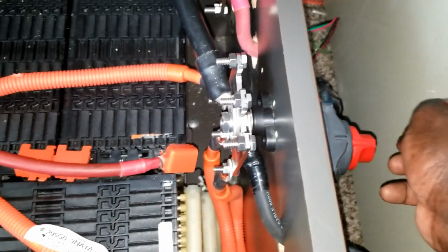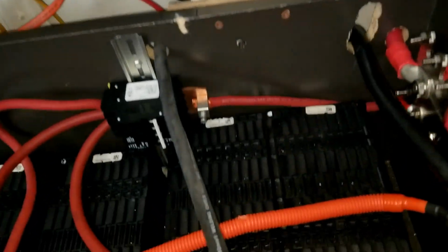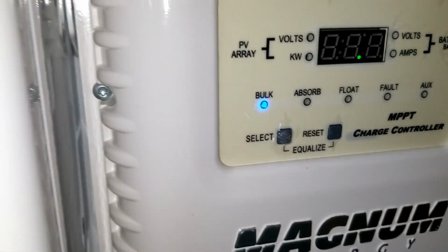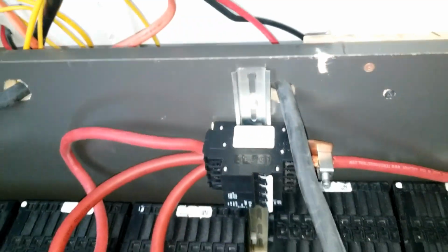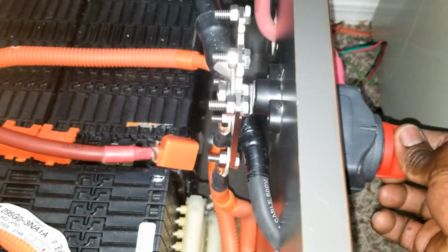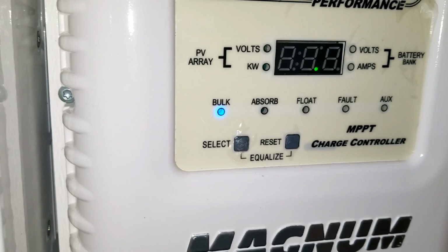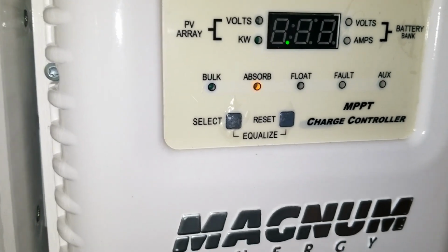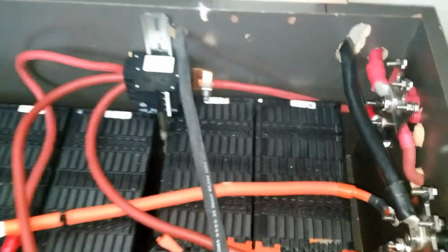So by this time, if I flip this one backwards, anti-clockwise, then this battery is already disconnected, and those ones are going to stay on. But we can do that if I flip the switch, just to show you. The power is still on. Now the Ford Focus is already disengaged. So we're going to turn this back on. And it's already engaged. I'm going to do back here, disengage, and we're still on. If I try to disengage, you could hear something different. There you go, power is going down. So we already know that this guy is already disconnected. There is a switch that tells you. So now we're going to operate on just the Ford Focus. The changeover is completed.